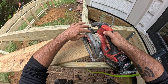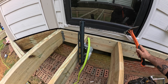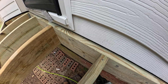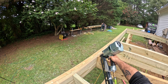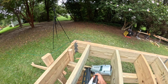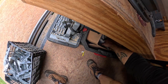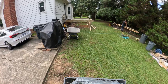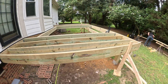I'm going to have to do the same thing to this other side too. I'm going to have to get these little bad boys. A lot of people seem to think that they don't need to fasten the outside other than just with nails to the outside band. But when you do that, you risk the chance of the outside band separating from the joist.